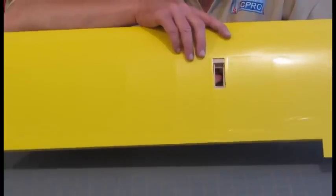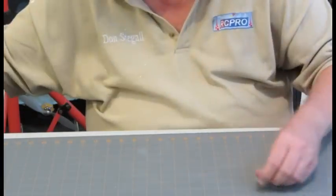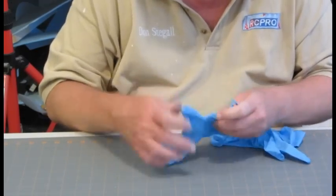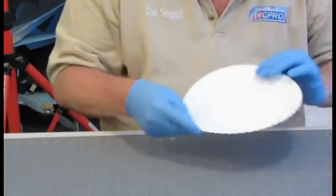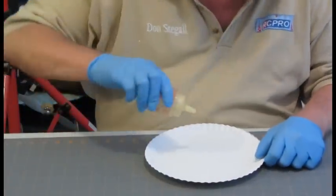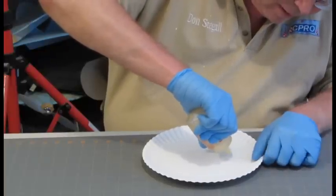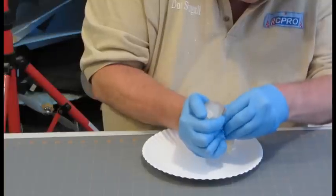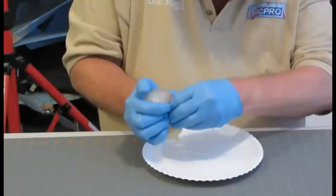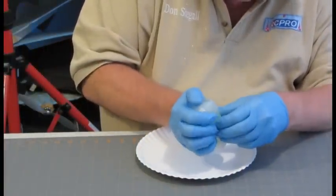What you're left with is the cavity where the servo fits right into. So I'm going to glue it in and I'll show the servo in place and we'll be done. I always wear gloves when I'm handling epoxy — it makes cleanup a lot easier. And for mixing epoxy, I use paper plates a lot. This is just System 3 5-minute epoxy, which is one of the best 5-minute epoxies I've found. You really only have about 3 minutes from the time you get it fully mixed until it starts to go off, so you have to work pretty quick.